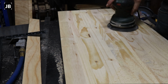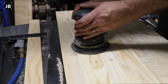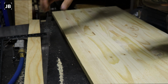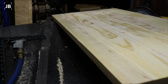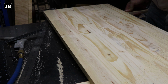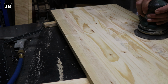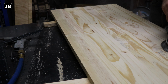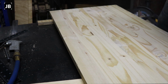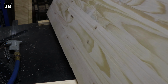Now this is the second reason why you will not win back your time on this. This is now a piece of board shelving that is absolutely a nightmare in terms of it wasn't flat, it wasn't straight, it wasn't smooth, so I had to do everything. As you can see there, I'm putting little pieces of wood underneath. If you're working with wood on a steel table like I am, always put some wood underneath. If there's any little nick on there, it tends to press into the wood and ruin your finish.